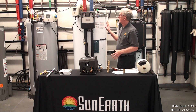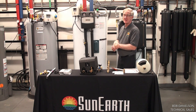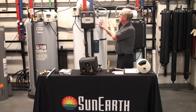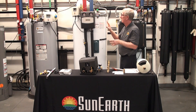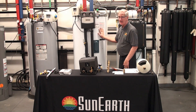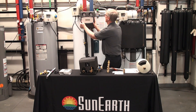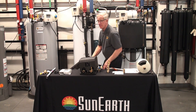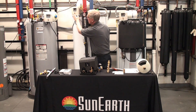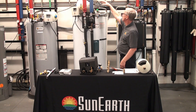The station is built here, tested here, ready to ship when it's finished and tested. You order it as a solar hot water station. This is the completed unit. The main part is the tank for the station — 80 gallon or 120. There's a pump station that comes with a cover, and that's the pump station — it's kind of the heart of the unit. And then we have the solar control on the side, an electronic control, various plumbing, an expansion tank, and some valving.